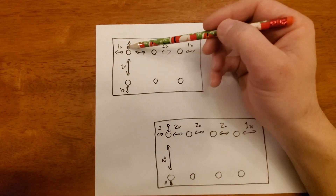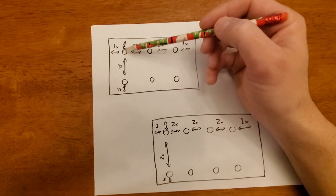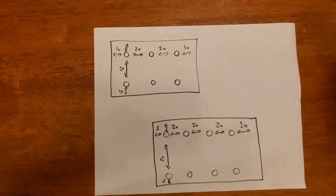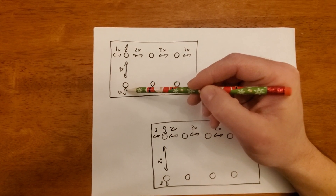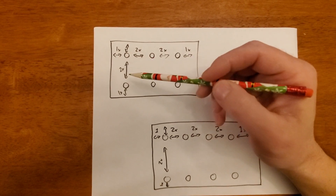It works the same here. If you've got one X here, then two X between the pot lights will give you the best spread of light. For example, if from this wall to the center of the pot light is 24 inches, then you want the space from pot light to pot light to be 48 inches.